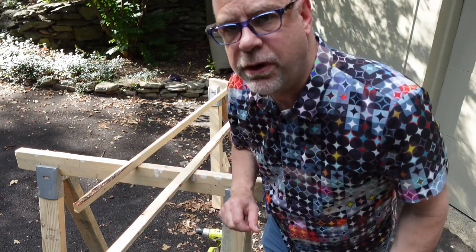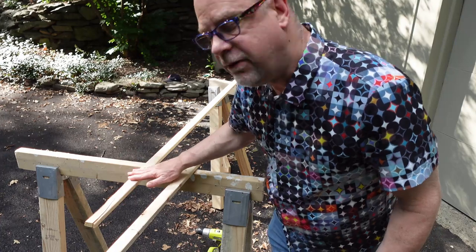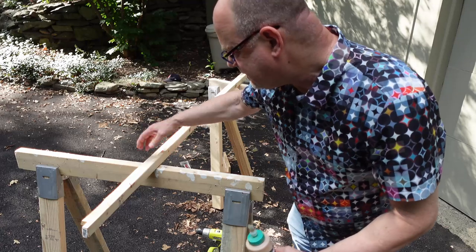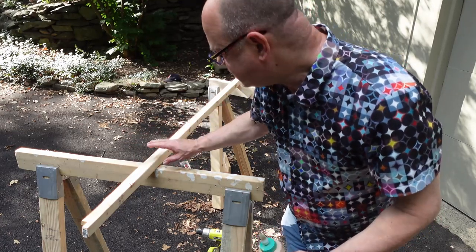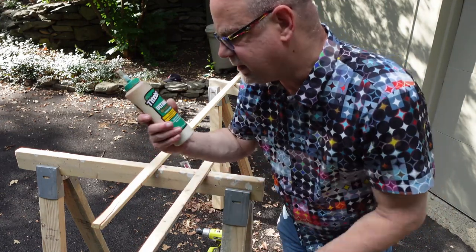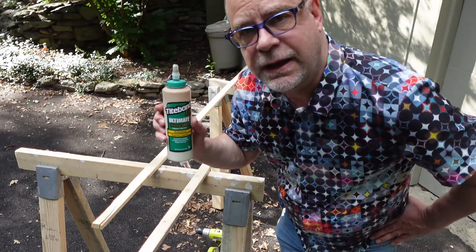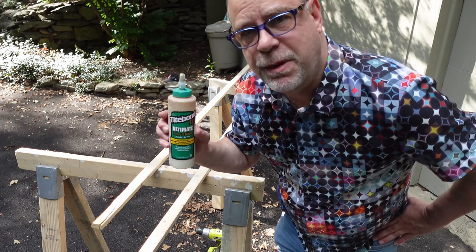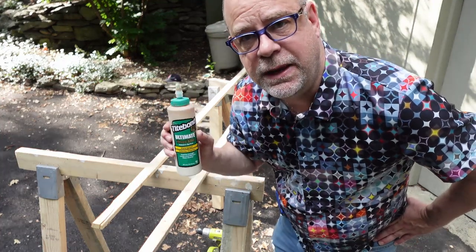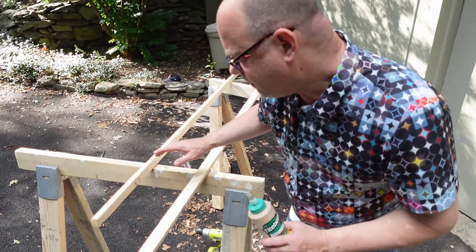It's going to be behind our artwork in the long run, so it won't make a big difference. This is going to be a temporary frame for us as well, and I'll show you what I mean with that. What we want to do is take the strapping and put one of these down flat like this, and the other one's going to butt up against it on its edge — so in essence we're making a bit of an L shape. In order for this to work, we need to join them together, and we're going to use a combination of wood glue. I recommend Titebond III. When this stuff dries up tight, it's probably tougher than the wood — I would be more concerned with the wood breaking than the glue. It also becomes waterproof if you're using anything outside that might need to be weather resistant. We're going to lay a bead down on one of these sides and butt these guys together.